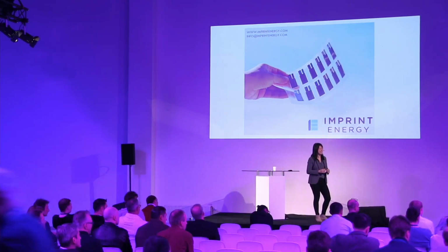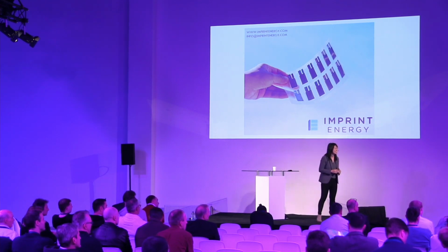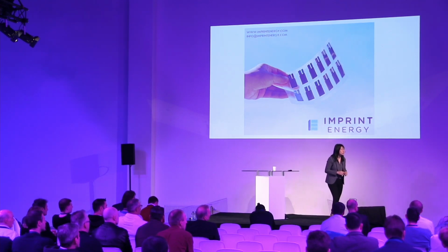Hi. What is the temperature operation range of your battery? Yeah. So we've tested at this point down to I think -30°C and up to about 65°C. There are impacts. Batteries of all sorts are impacted by temperature. So in colder temperatures, internal resistance goes up. At higher temperatures, internal resistance goes down. So it's balancing that impact with your application.